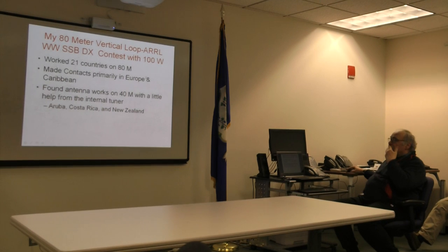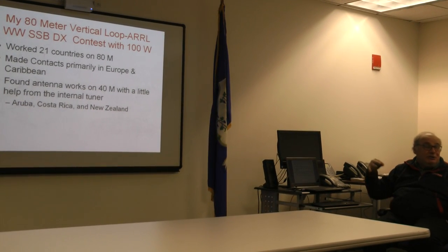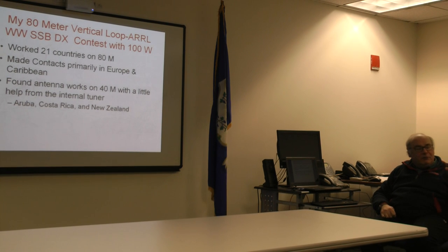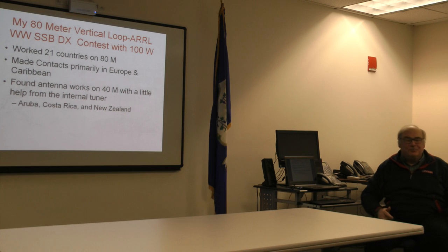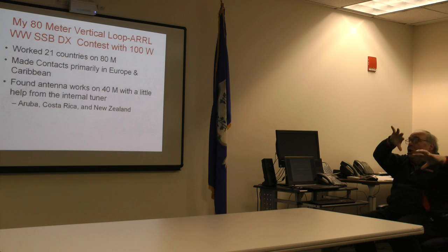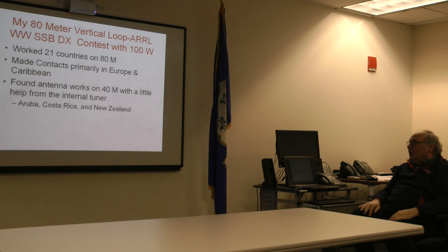So what were my results? I worked 21 countries on 80 meters. By the way, that's not an extraordinary performance. That's just me trying to work the antenna. The best year I had working with the dipole might have been 14 or 15. However, I'm not saying the loop was superior. I stayed the entire contest on the 80. That was the difference. Where were the signals coming from? As you would anticipate, some of the Caribbean off the backside, or, I'm sorry, the Mexican Peninsula basically off the backside, the Caribbean off the side, pointed to Africa.